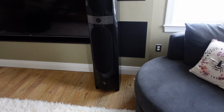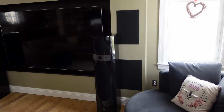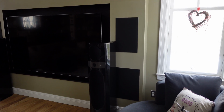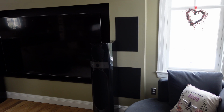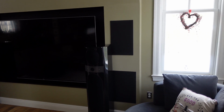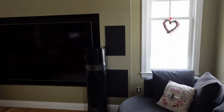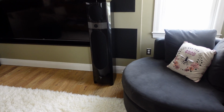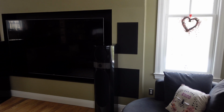If you measure, you can kind of see where the wall takes its angle. So an in-wall needs to be below that point, and then of course above the trim. I don't have enough height here relative to where the subwoofer is in the wall right now to put a Utopia. If I were to do a Utopia, that thing's, gosh, on the order of 30 some inches, 40 some inches tall, and I have less than like 6 feet of space from that angle to the trim, and of course you'd want to leave a few inches above and below so you're not risking cutting into wood or weakening any of the points where everything comes together. So there's no way I can fit a Utopia and a sub.